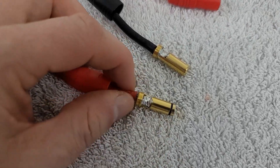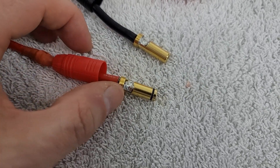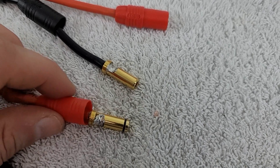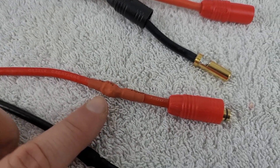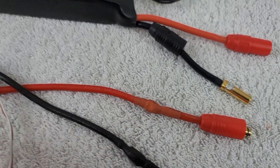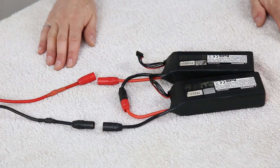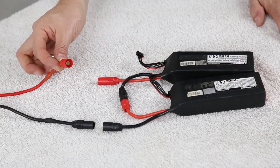Here is the first joint I ended up completing. Oddly enough it is the one that has the resistor located on it. All I need to do now is take this housing or cover, slide it over the connector, and it threads onto those threads right there at the very end of the connector. Here is one that is already done, and a positive connector here on our battery pack already done. Now one of the things that I had to do with this particular speed control is extend the wires by an extra inch just to allow it to get out into the cockpit part of the airplane. I had to make sure beforehand that the ripple voltage is not high. I already tested that with this extra one inch. If you don't know why this can be harmful for your electronic speed control, I would highly recommend taking a look at the video that I'm going to link in the description below.